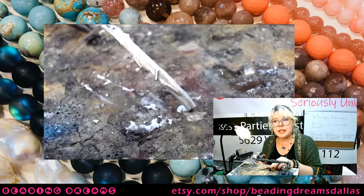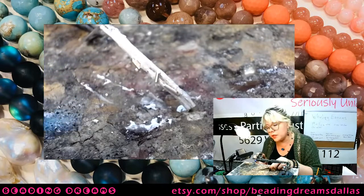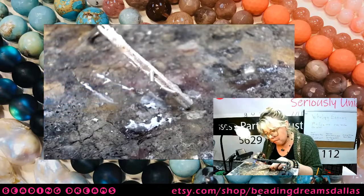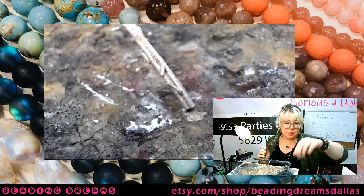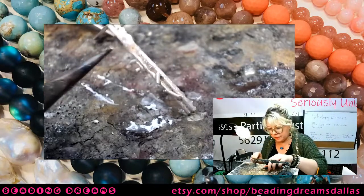So that means that any tweezers or third hands, clamps, anything you're using to hold this, is potentially a part of that heat sink effect, and it's just something that people don't always think about, because they think about the metal that's part of your project being part of the heat sink effect, but they don't actually think about the holding bits as well.